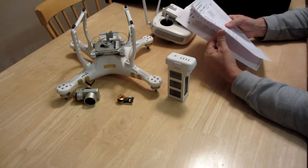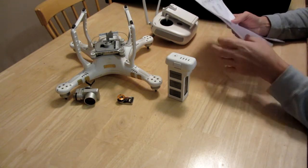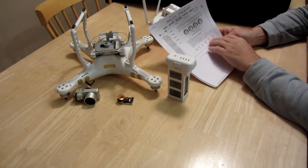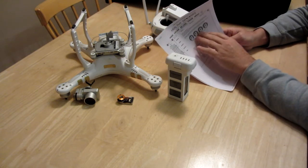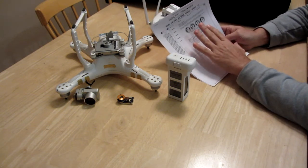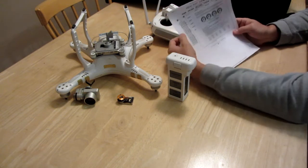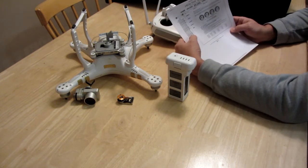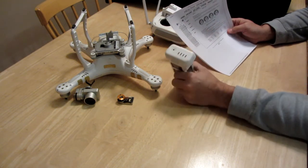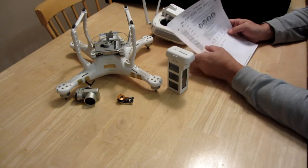Part of it is going to be on the condition of the cells in the battery. When you look at this on the website, you'll see a few numbers are going to be in red, but the deviation is really not that great. Also, as the description points out, this is only accurate if you get several minutes of usage out of the battery. I upload pretty much everything — all of my logs — and I look at them after I fly to check for errors. I've flown with this particular battery many times and checked it many times — never had an issue with it.